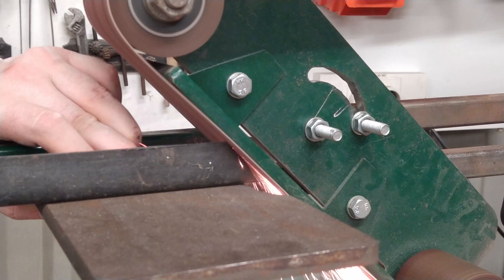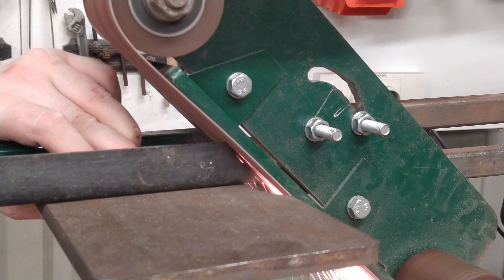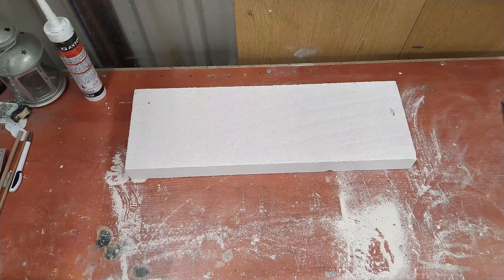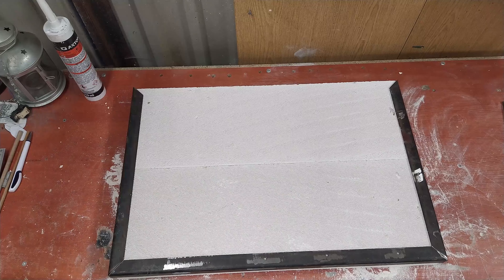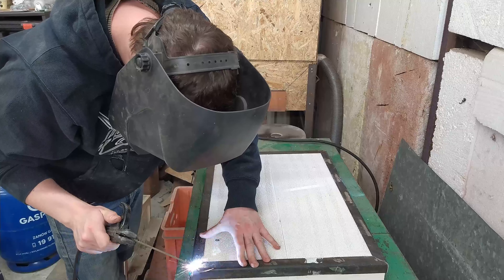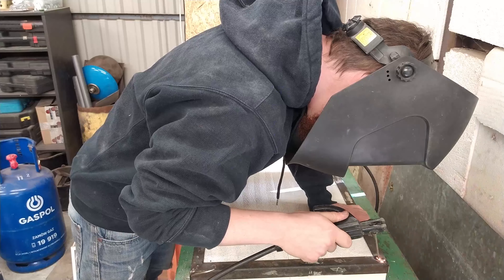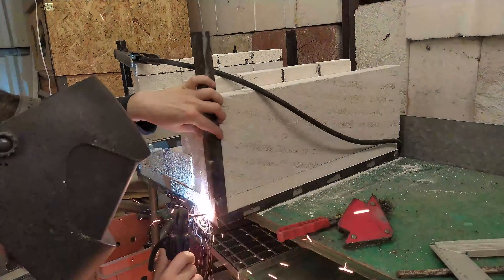You could ask why I didn't buy mineral wool, of which the thermal conductivity is much lower — 0.037. And the answer is simple: the price. I couldn't get mineral wool by the piece, only by packages, which would cost quite a lot. So instead I just spent $5 and bought 8 insulation bricks, and this extra 5 bucks saved me 80 watts of power. You could probably say that's not a huge number, but if you check the percentages, there is 30% of total losses saved — so this is a huge number. The more power you save, the quicker your oven will heat up and the easier it is to reach 1000 degrees Celsius.